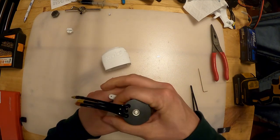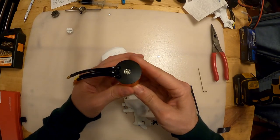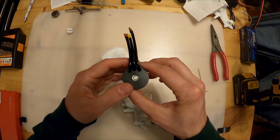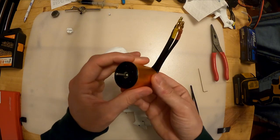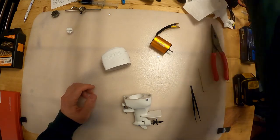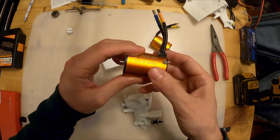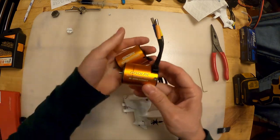It's a brushless motor. Brushless motors can run underwater because there are no moving parts to it. Honestly, all I do is these motors have two bearings, one on either end, and I give them a shot of lube. I've got some Teflon-based lubricants, but WD-40 or some other lubricant would be fine after a run. And I've had no issue. Let me show you one of these. This is one of the battle-torn motors I've had. One of these cheap ones, they can sell them under a ton of different names. Obviously this one, what is this one called?